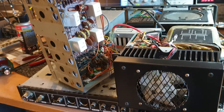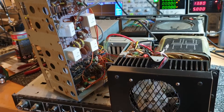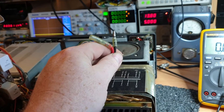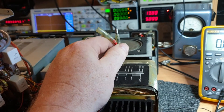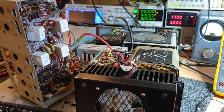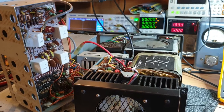So just one of the first things you do on a TS-930 output problem — you want to check your 28 volts coming off here. The difficulty is that you sometimes will get 28 volts off there, but of course you're not presenting a load at that time, so sometimes you need to load it up and have a look. We were getting 28 volts off it, but honestly that really is the least of our problems at the moment.